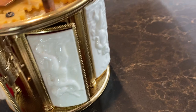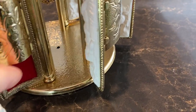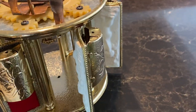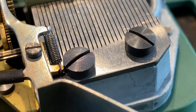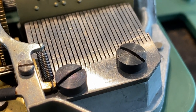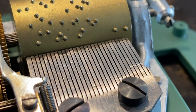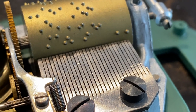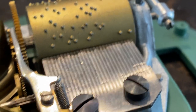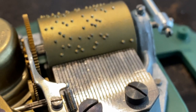Real simple — it's a mechanical music box that the doors open and close on. Just to give you a little sense, the cigarettes would go right in there. These two big screws here — when you loosen and tighten them you're able to adjust the distance from the ends of those forks onto the bumps on the pinned barrel. Some of our bigger pin barrel machines work in a similar manner; rather than go directly to a tuned fork, it goes to a function that will open and close a valve for a pipe to blow.